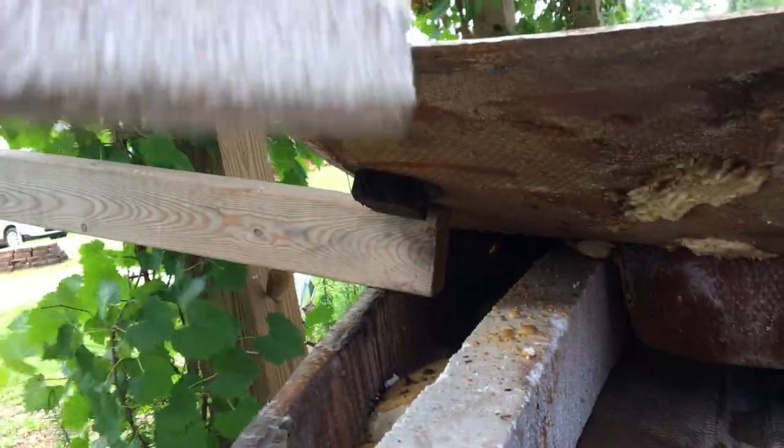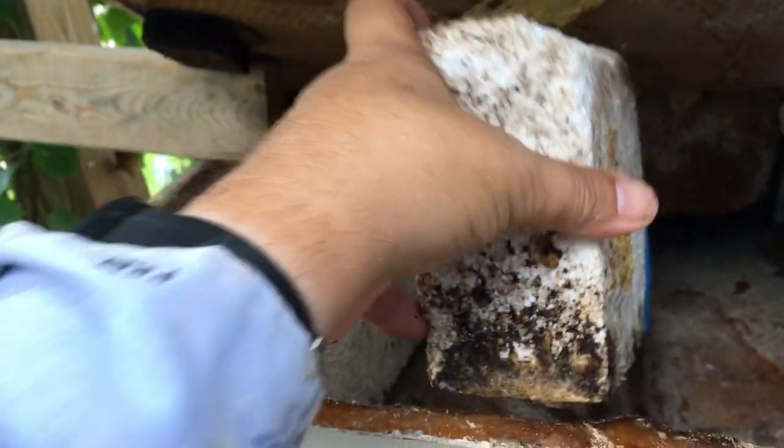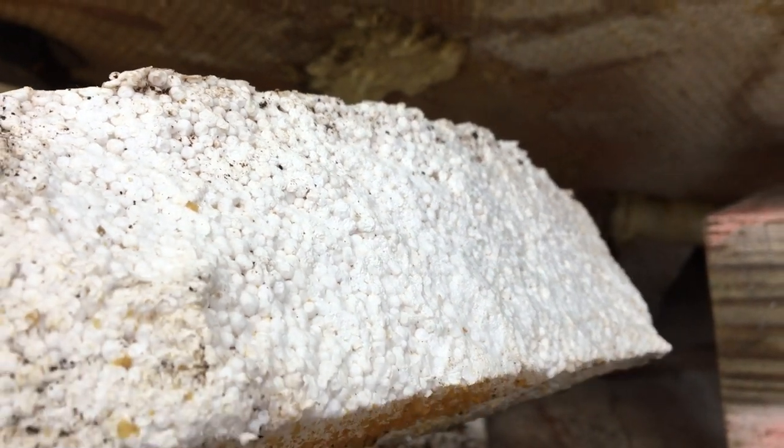In the middle we pulled up the center flotation block — it goes up under the decking, so it's going to slide back into place there. And here's the starboard block with a little fracture in it. We'll put some — probably they used foam to adhere it right together.